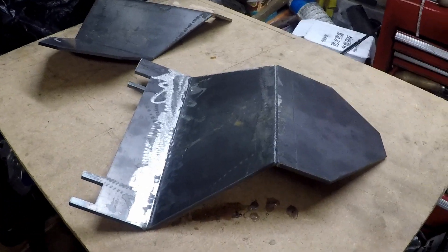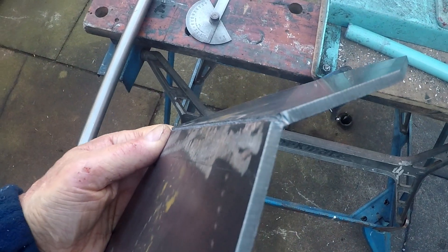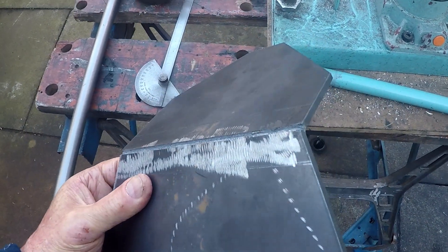I've had to make two plates and with all the bends done it's not looking too bad. The inward facing seam did burst out but I was sort of expecting this — I'll just run the welder down it to fill it in and it'll be fine.